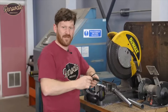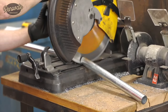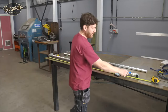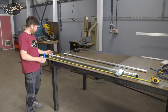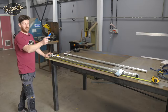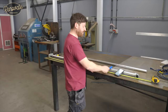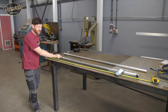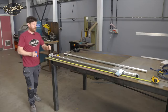One thing you must remember whenever cutting: personal protective equipment every time — eyes and ears. We've got our side lengths cut to length and are ready for marking out the holes for running the cables through for the lamps. We've put the top and bottom clamps on, seated right into the end of the bracket, taken a measurement from the top of the base plate to the center of the top bracket, and divided it by four — giving a spacing of 445 millimeters for our three holes.